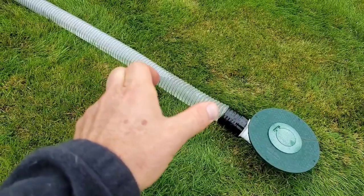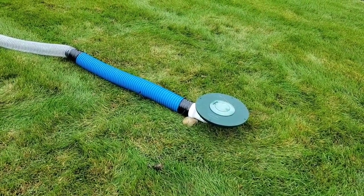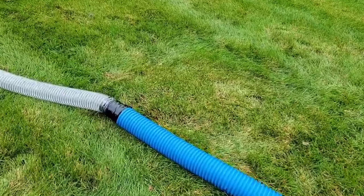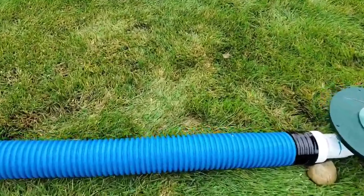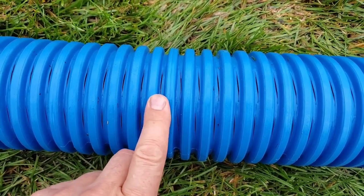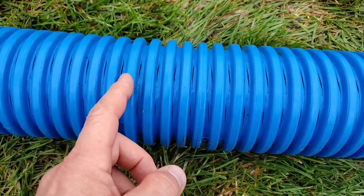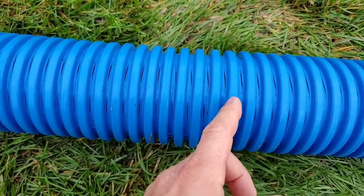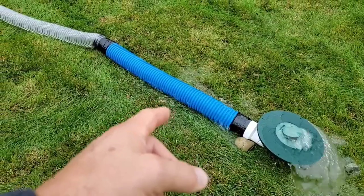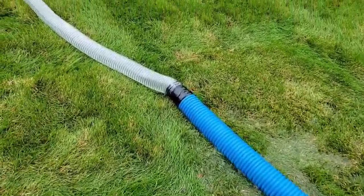The few cups of water left behind in just a few feet of four-inch pipe — we're going to take care of that and show you how. We went ahead and added a few feet of knife cut pipe. Knife cut has a really small cut in it with no material removed, unlike our eight-slot or four-slot staggered pipe where actual material is removed. Knife cut is just blade cuts — no material ground out. When we install this, the knife cut sits in stone and fabric, just like our French drain system.